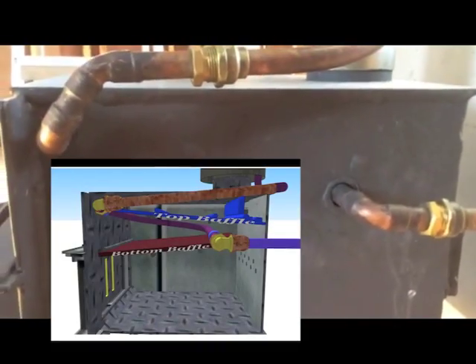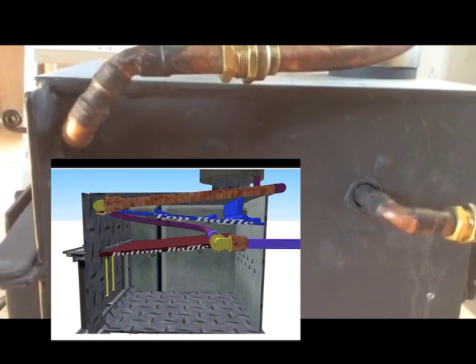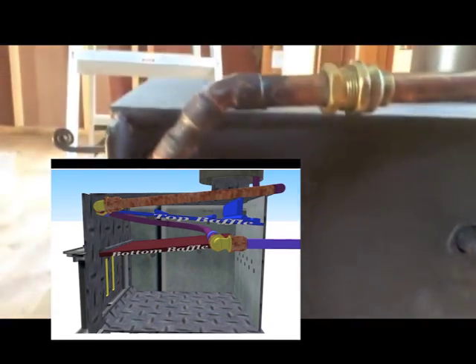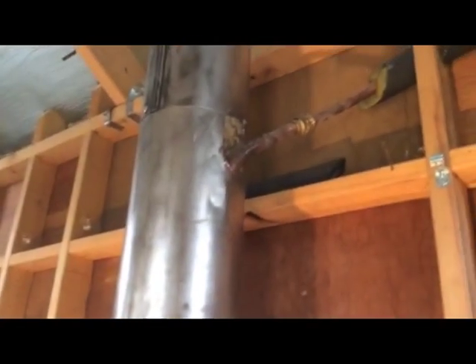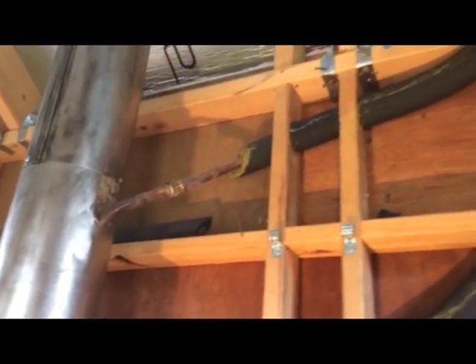That nice hot flame on the pipe warms the water, it rises and rises and up through this pipe alongside the chimney, then exits about three-quarters of the way up the flue, comes across again through the wall, and then back out and comes in about halfway up that tank.